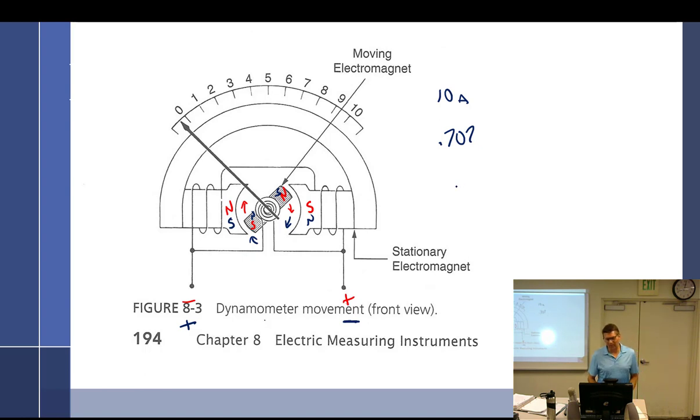So we're going to get more into that, but there is a function in that. So it doesn't actually read correctly. If we looked at an oscilloscope and we saw it peak out, and this peak right here was 10, and then it comes back down and goes back up, and this right here is 0, and that'd be positive 10, and this would be negative 10, and we're measuring that, it would not, in fact, say 10. Because you're actually averaging these out. Well, you're not really averaging.